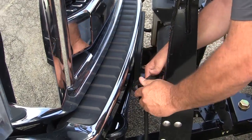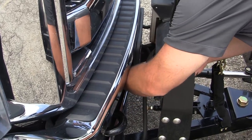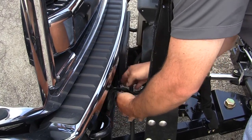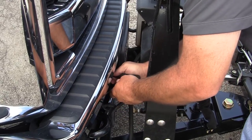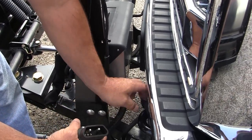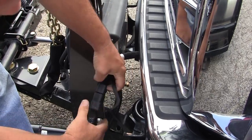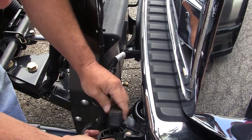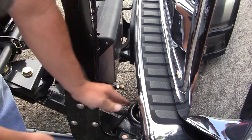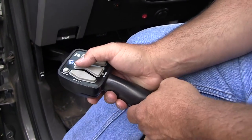First, we'll do the lights. Take off the safety cap. Make sure there's dielectric grease. Next, we'll do the power cables. Again, make sure there's proper dielectric grease. Make sure we have a good connection. Usually put the caps together and kind of tuck it away a little bit out of the way. After we have it all hooked up, we're going to do testing, go up, left to right